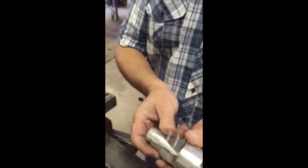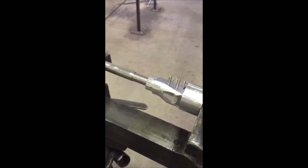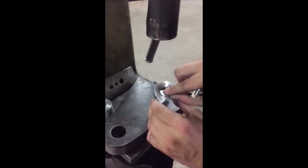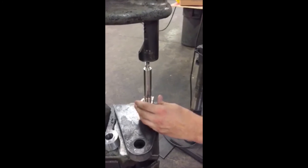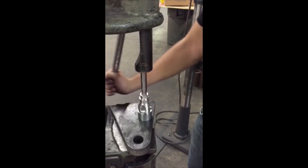To remove the bushing, use the spacer on the front of the vise with the bushing press tool. The bushing press tool will go against the washer that was inserted to help press the bushing out — you'll see the washer and bushing come out together. To reinstall using an arbor press, put the washer in first, line the bushing up, use the bushing press tool, and press it in until it sits at the bottom of the head. To remove with the arbor press, insert the bushing press tool into the back of the head and press it out.